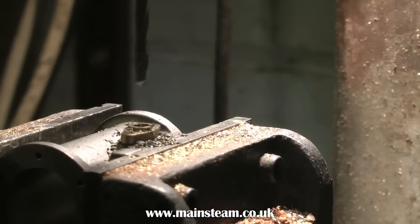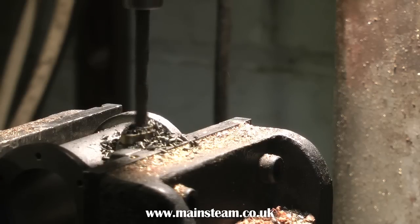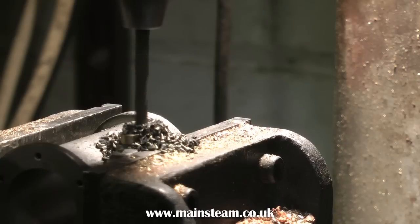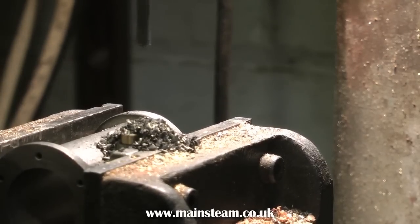When drilling the centre hole be very careful — this centre hole needs to go all the way down to the exhaust port, which is right in the centre, the square hole. You need to clear the chips because if the chips grab the drill then you may break the drill, and breaking the drill in the work at this stage would be fairly disastrous after all the work that's already gone into it. Cast iron of this quality generally does not cause problems with grabbing, but always withdraw the drill from time to time to clear the swarf. Don't put too much pressure on, and be very careful as the drill breaks through into the centre port.